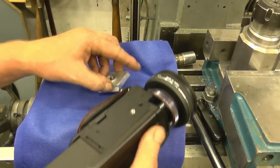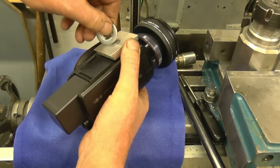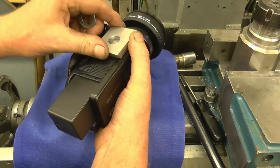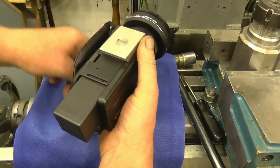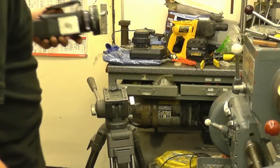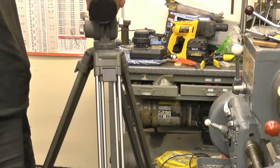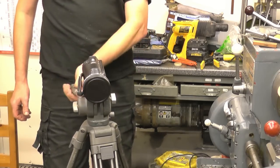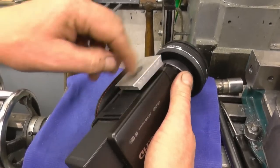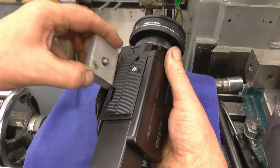This is my good camera that I use in the workshop — the one I use filming outside, steam rises, or whatever. That screws into there; I just use a coin normally to tighten it. There's actually a little pin hole in the camera — there should be a little pin to locate it. It simply goes in like that, drops in, and that cam locks it in — that's it. A nice solid base. There's a little locating peg there, so what I'll do is drill that and put the locating peg in line, and that stops it from twisting.